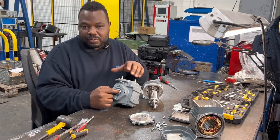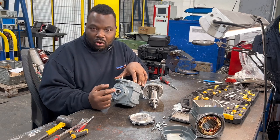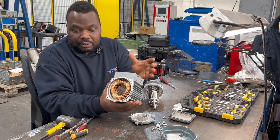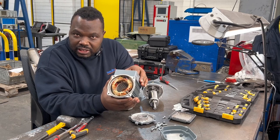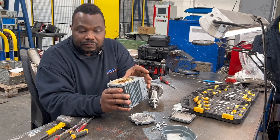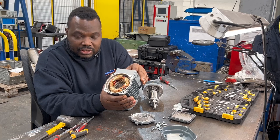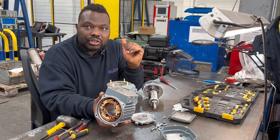If it's an emergency, we can make a new hollow shaft ourselves, or we can get it cheaper from SCW. When oil gets into the winding, sometimes it might pass the surge test — we put it on the surge test machine which tells us exactly what we need to know about every job. If the winding is all right, we steam it and put it in the oven to dry. If it doesn't pass the surge test, we rewind it. That's a common fault on SCW gearbox motors.